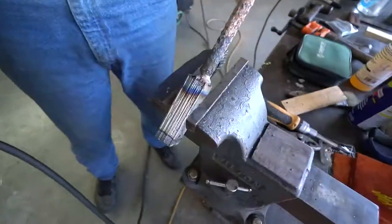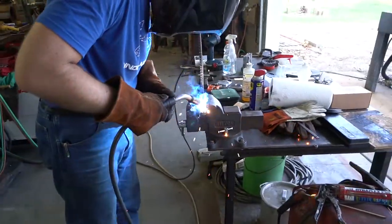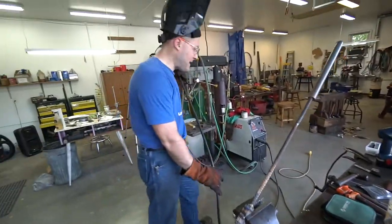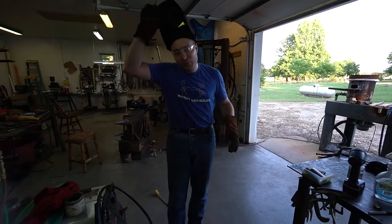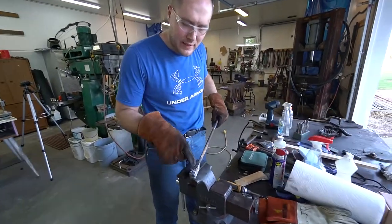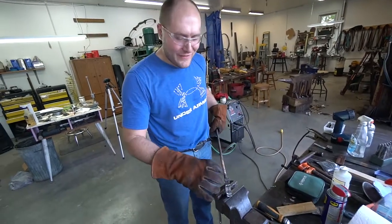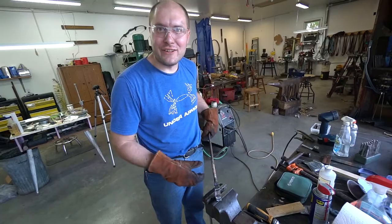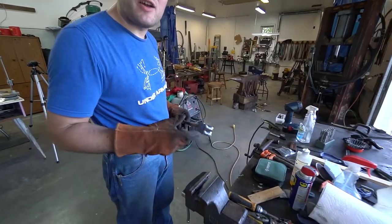So Kyle, before you weld that, tell me, have you ever welded anything to your vise? Oh yeah, lots of times. What'd you weld to your vise? Billets of Damascus. This is actually a Damascus right now that we're making. It's all out of one type of steel, but it's definitely pattern welded steel. What makes the modern day pattern welded steel is multiple layers like this alternating. You'll have two different types of steel and they'll alternate one after another. That way when you etch it in acid after you forged all the layers in there, you'll be able to see all the variation in the pattern from the two different types of steel etching differently. Basically, whenever you get two different kinds of steels and mix them together, you got Damascus? Pattern welded steel, we call it Damascus. True Damascus is made differently, but this is kind of the modern version that most people do.